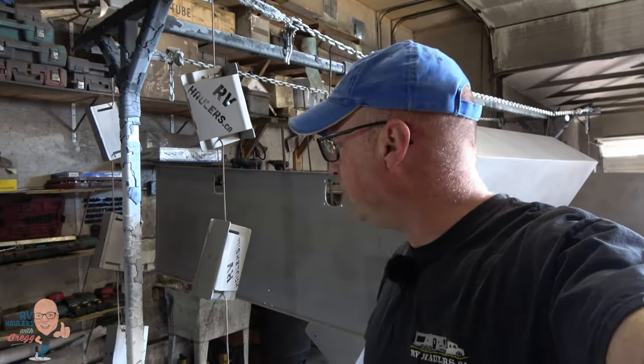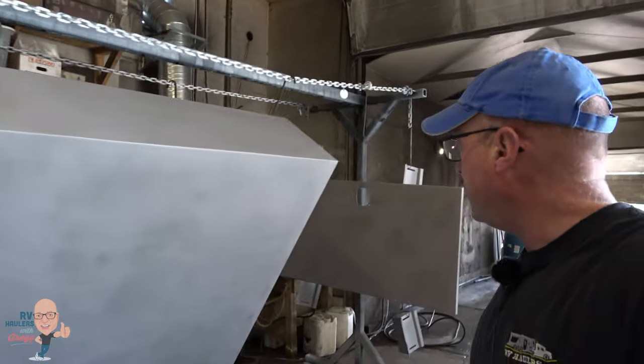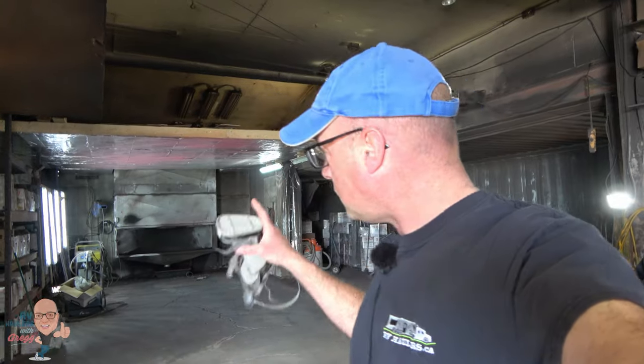We watched Sarah bring our project here into Rockyford Powder Coating. You can see we've got our chocks prepared, the DROM box door, and even the DROM box suspended — we're going to pull it into the powder coating prep area first. This is the area where we're going to be applying a carbon black powder coat product. We're going to electrically charge the rack and the carbon black is going to be attracted to it. What you see behind me is an extraction vent — all of the excess particles are going to be drawn up and out. We'll all be wearing our PPE, so we're keeping safe.